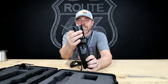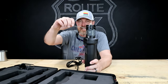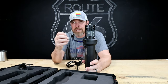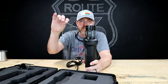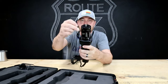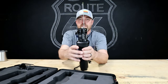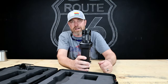You can go from 15 degrees all the way around — here's 22.5. You just turn this thing on, stick it in there, turn the tungsten, sharpen it nice and sharp, pull it out, and you're ready to rock and roll. Sometimes you want to sharpen it but then kind of dull the point — right here on the end of this thing you can slide this right on top and it's going to dull the tip after sharpening. Slide it down in there, knock the point off, and you're ready to go.